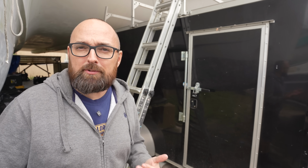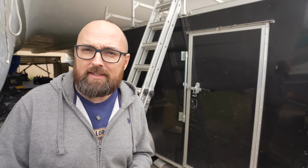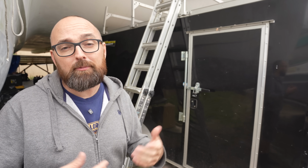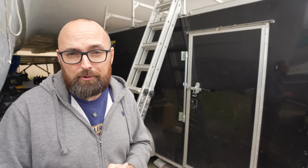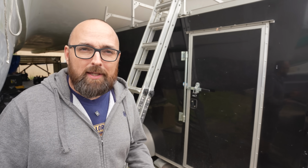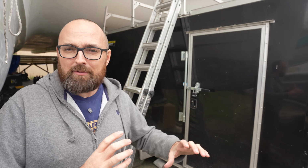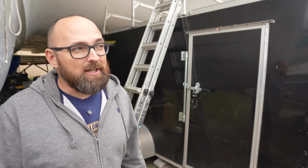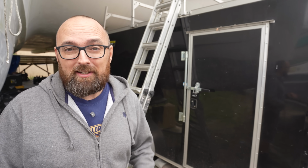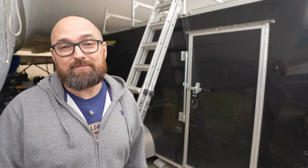I've seen a couple of posts on the Antares 44 owners forum about the tubes wearing out, and I think there's also a single YouTube comment pointing it out, that when the chain runs through the fiberglass tubes, eventually they will just wear through and need to be replaced. And once that happens, I have this little plan of making a more gold-plated solution of a stainless steel tube that's lined with some PVC or something like that. But before I attempt something like that, I want to make sure that everything is lined up perfectly and working the way it's supposed to. So hence, we'll start with the fiberglass tubes.